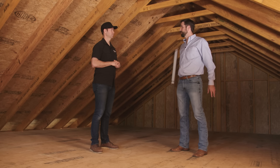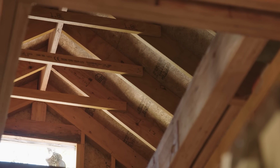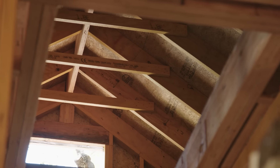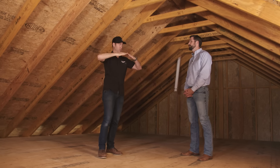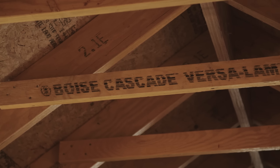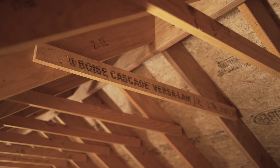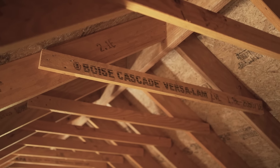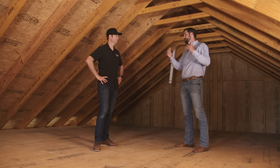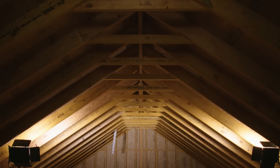Before we go downstairs, talk to me about these two-by-fours tying the two rafters together - are these collar ties carrying a lot of load? Almost every framer installs them out of habit. Many believe collar ties help prevent spreading similar to what the ceiling joists do, but in fact they really don't help prevent spreading much at all. Because they're so high, they're very inefficient and have essentially no resistance to spreading.